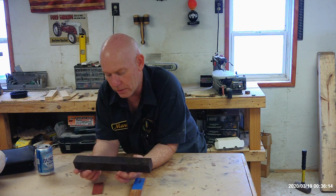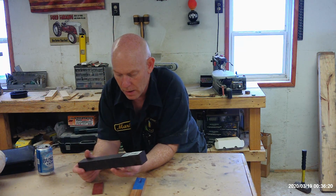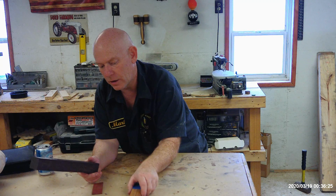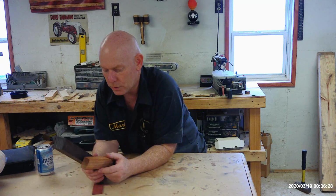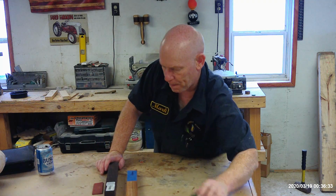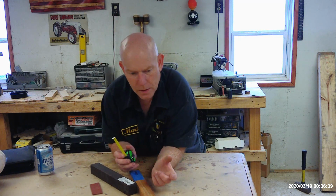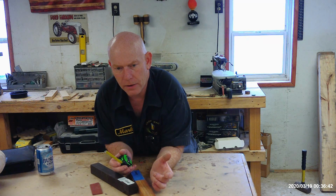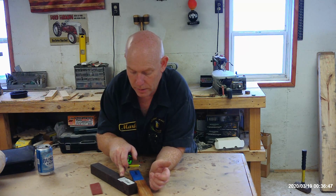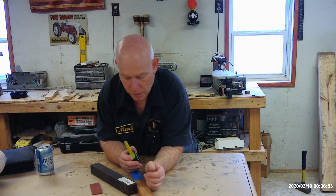I want a handle that's going to be roughly 7.5, 8 inches long. But I also need to have the hammerhead, so this one block isn't going to be long enough. We're going to utilize the canary to lengthen the handle. What we're going to do is, where's my tape measure? Since this block is 1.5 inches, I'm going to have a 2-inch tang on the handle that will extend through the head, which this is going to make the head as well. Gives me some room to work with when I have to put the wedge in and cut it all off flush.